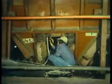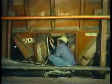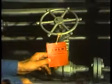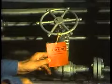Before you begin, check with your boiler operator to make sure that bottom ash has been pulled and all soot blowers have been blown. Then check to see that combustion deposits like ash and slag have been cleared from the boiler. You won't be able to get all of them, but the inside of the boiler should be as clean as possible. The boiler should be shut down and tagged out. Tagging out guarantees that none of the valves will be tampered with during inspection.